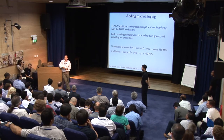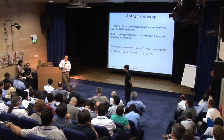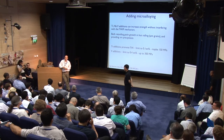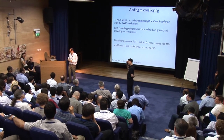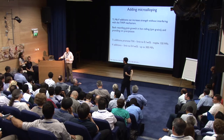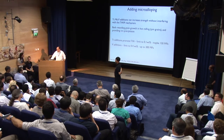Okay. Yeah. And my second question is, you have shown coarse grain TWIP and fine grain TWIP, and I found the elongation difference. I would like to know the mechanism through the twinning interaction and also dislocation and twin interaction.